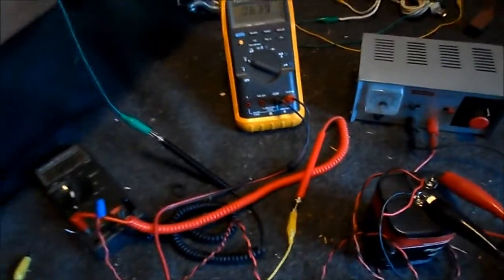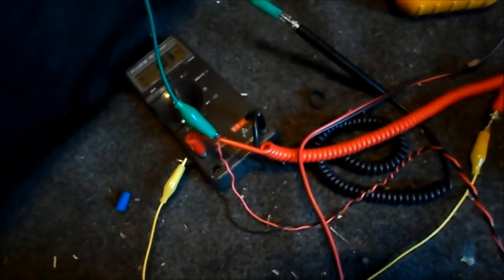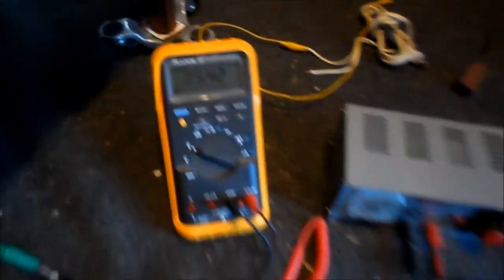More to come later — that's enough of this for right now. I'll try to find out why we only have low voltage, check some voltages, and get back to it. Just to save a little time, I got a lantern battery — it has 6.3 volts on it, no load. I do have a little regulated power supply but that's about an amp max. Let's see what it draws with the lantern battery attached. It drew an amp going down to 0.9 — I got 5.4 volts there, so that's 900 milliamps. That's a lot of current — 0.9 amps at only 5.4 volts.